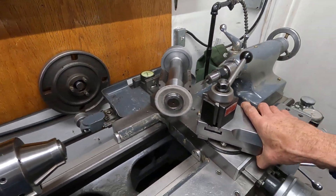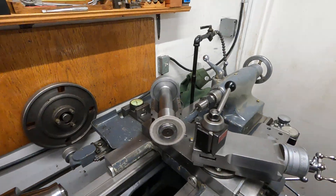This is what I use this machine for — this type of precision work. Most general work is going to be done on the old Axelson. I had another one of these — an older one that took the brunt of the punishment — but I found I'm better off with the gear head over there for roughing stuff out, doing the general metal removal. And that's the same with the jig bore: you'll want to rough the part out. You don't want to stick a big block of steel in the jig bore. You'll want to rough it out on drills and mills, leave about a 64th of an inch on the places where it needs to be precision, and then finish it on the jig bore in the Monarch 10EE. These machines — and the 10EE — is a machine for the artist.